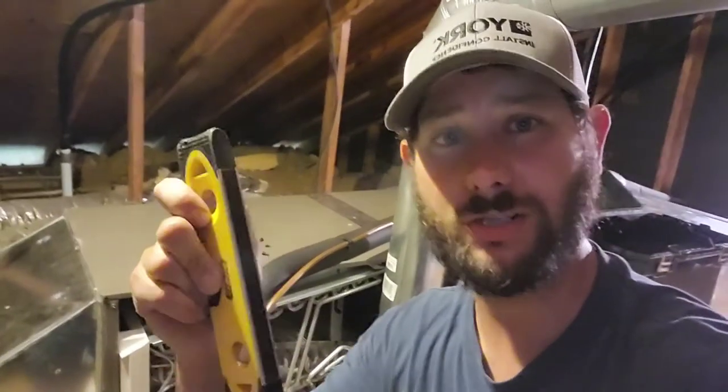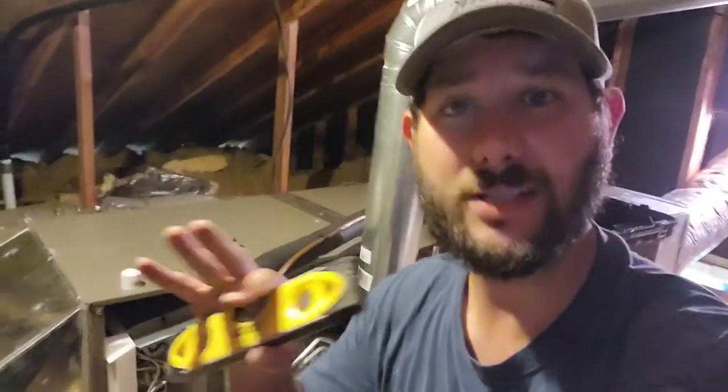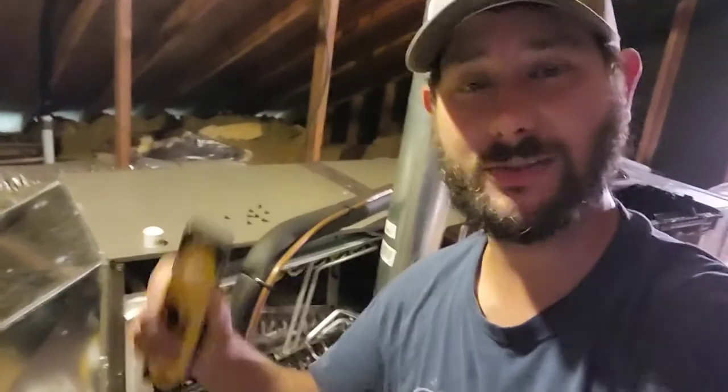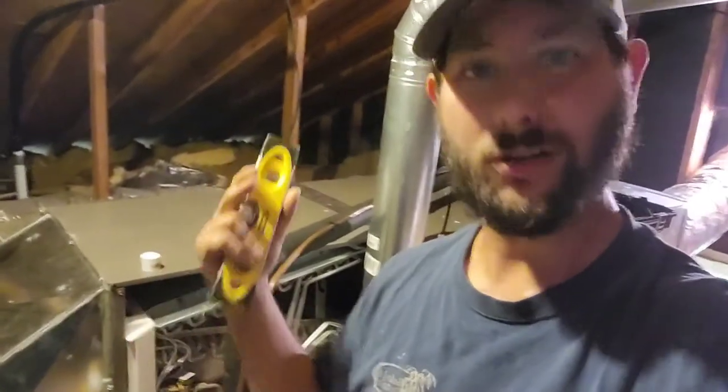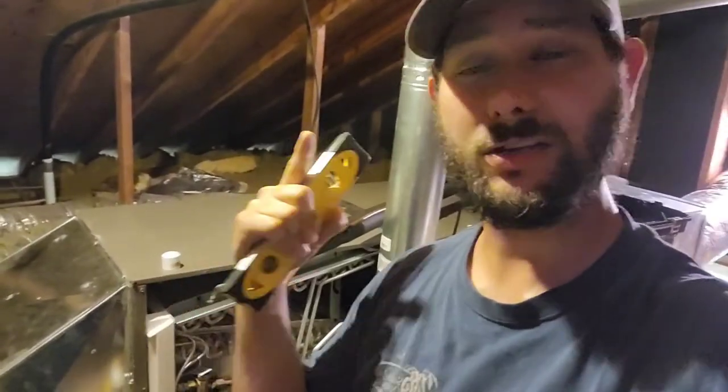A few more things you need to know about water in the pan: number one, you could have an evaporator coil that's not level — if it's not level, the water's not moving towards the drain outlet and it could be pouring out of the pan inside the case. Also, you might have a deflector or splash guard that needs to be installed in a certain configuration — refer to your installation instructions to make sure that splash guard is installed properly. It might also not be low refrigerant but low airflow: a bad capacitor, your indoor fan not moving enough air, vents closed, or a dirty filter. Think about all the different possible problem areas so you don't have a callback.